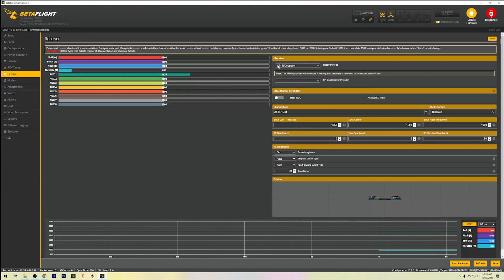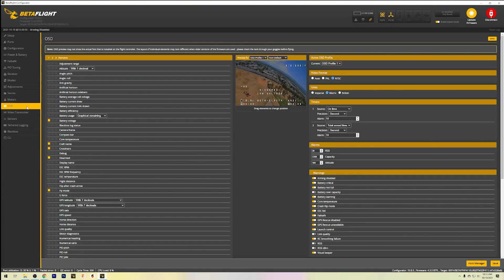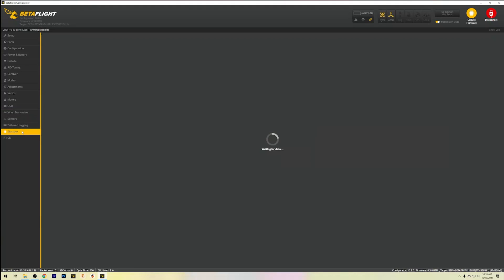Back on the receiver tab, we see SPI RX support is shown with nothing under SPI bus receiver — remember this is pre-release firmware, so don't mess with it, it's set up to work as-is. OSD is set up for whatever configuration. Under video transmitter, obviously nothing since there's no VTX built in — you'll need to set up your own VTX tables when you solder on your VTX of choice. For blackbox, there's obviously no blackbox on this super cut-down board. You can add an OpenLogger on that one available UART — it's basically an SD card-based blackbox added over UART, and it's the way to tune micros that don't typically have blackbox.